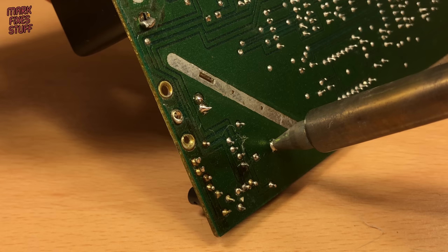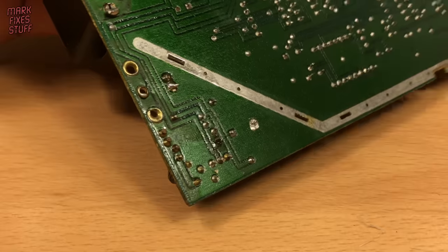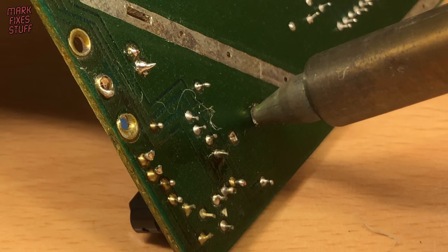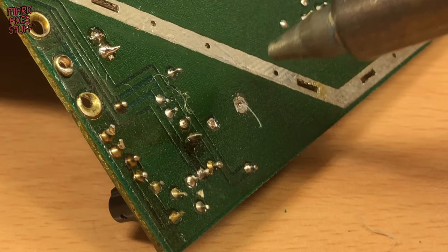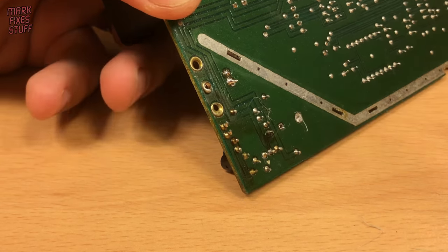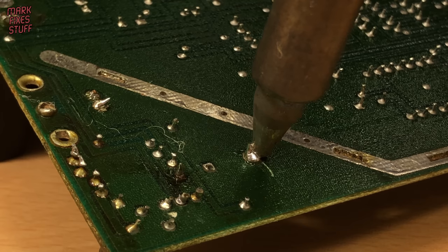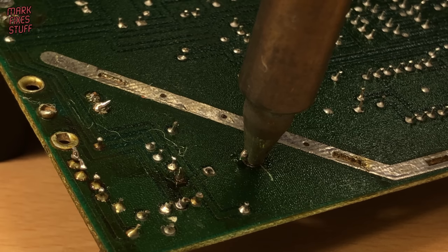There are only three electrolytic capacitors in an Atari 7800 and they're all connected to a big ground plane that steals the heat from your tool and makes it hard to get the old solder flowing. The positive legs of the caps are easy to remove, but those pesky negative cathodes are a pain. I knocked the heat up on the desolder gun 20 degrees to 350 degrees Celsius and that helped, but the hole didn't clear. I usually fix this with a fresh blob of solder — the fresh solder gives a larger thermal capacity on the hole and helps the gun get a good suck.